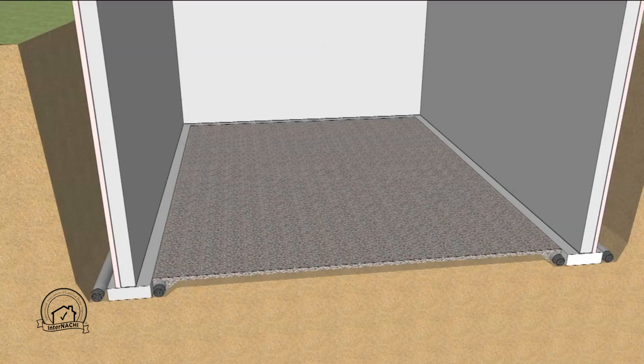The gravel layer also allows the removal of radon from beneath the slab if radon is present. Gravel wrapped in filter fabric is also placed around the exterior drainage tile to allow for drainage at the bottom of the basement wall.